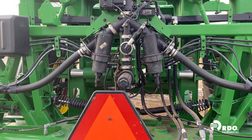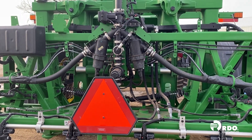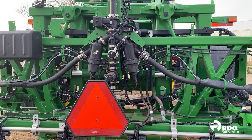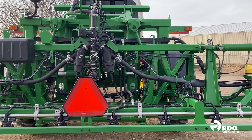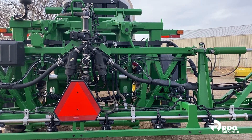What kind of rate issues can our strainers cause? Generally, our strainers will cause issues with achieving rate. Instead of the sprayer reaching the target rate, if our strainers are plugged up or restricted, we'll find that our pump can't overpressure the strainer and we'll hang below our target rate and never achieve it.